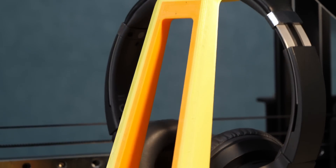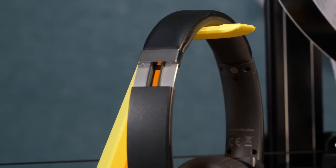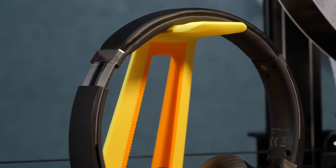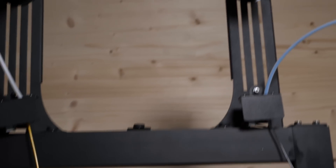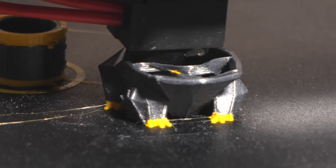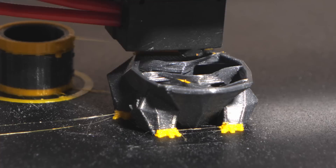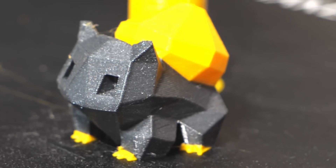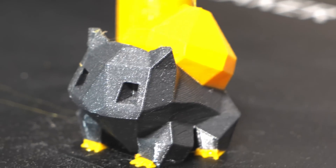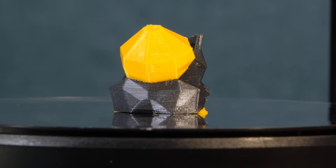Once I was satisfied with the dual color PLA, I wanted to test out flex material, because that's usually where these extruders lack a bit. I threw in a couple of spools of flexible filament in my dehydro spool and printed the OG Bulbasaur by Flowelistic. The print was done at 40 millimeters a second with a retraction of about 2.2 millimeters. The result was actually quite surprising — while not the cleanest, it still printed out quite beautifully, and it did it very well, especially since this was a dual flex print.